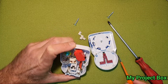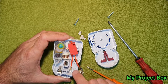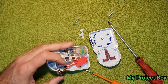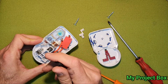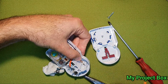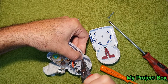It looks like they've been spot welded on, but I don't think it's a big deal. We can undo this connection here — yeah, that's easy. We can cut it there and solder this one onto the bottom. This one has to go to the bottom. Let's break this connection here. It looks like we can possibly put this one into the crimp at the bottom and it should reach. Let me put a bit of solder in there and re-crimp that down with the long nose pliers. There we go.